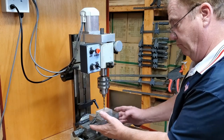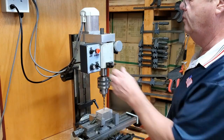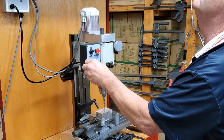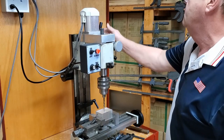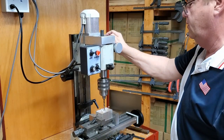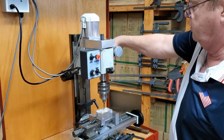Notice how little travel I've got — I've got a big vise, a big chuck, all the big machine stuff on the little machine — but that's so we can show you just how far it can actually go. We're going to punch a hole at about 800 to 1000 RPM on the motor. I've heard people say they couldn't drill through 6061; we're going to drill an inch and a half through it.